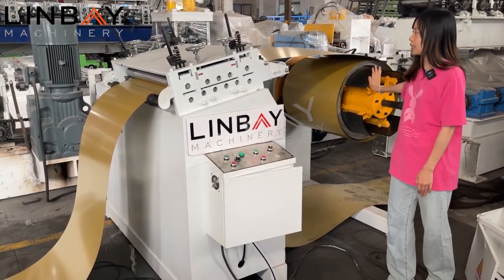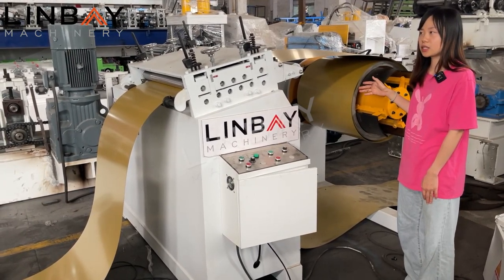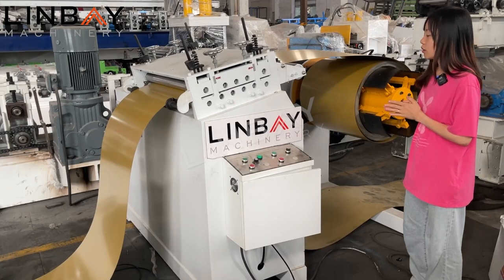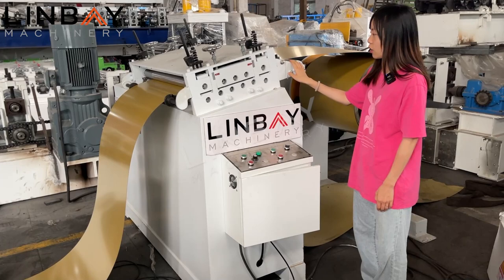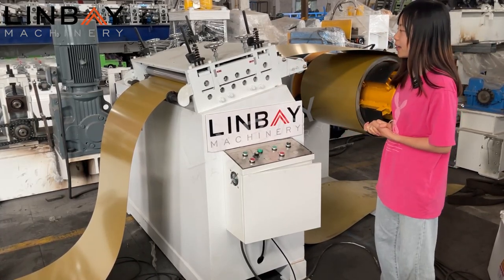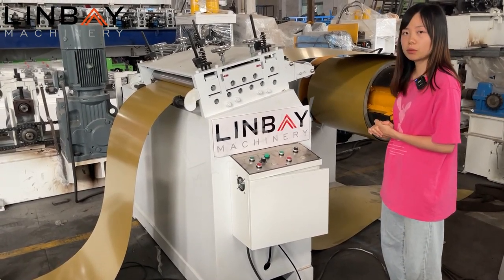And next to it, you can see the material used here, the thickness of it is 0.6 to 1.2 millimeters, and the yield strength of it is over 300 MPa. So in this case, a leveler is necessary when the strength is high. And you can see this is not an independent leveler, it's an integrated leveler. It requires a smaller area and it can be more affordable too.